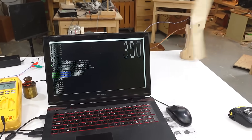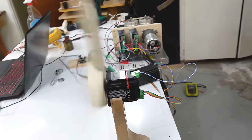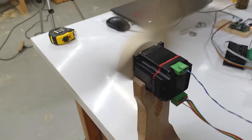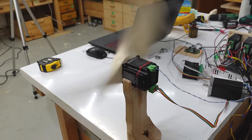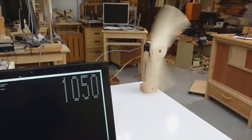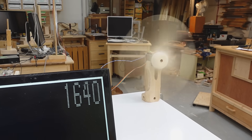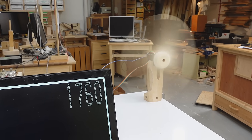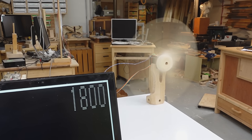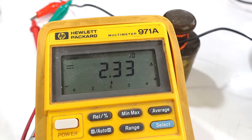My next test is spinning up a fan with the stepper motor to see how fast I can get it to go, starting with the smallest — this closed loop stepper motor. My program doesn't know when the fan stops running so I just have to watch the RPM meter. The best I was able to do is 1820 RPM, and for that it used 2.3 amperes at 32 volts.